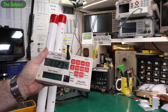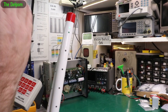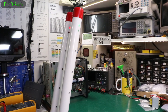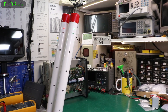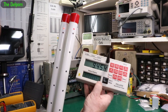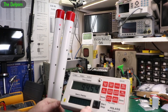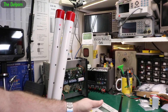It looks like it had just forgotten its programming. Going back into the RF testing — the first one is coming up as F like before. Now the other one is showing zero, and it's beeping but showing zero. Is it overdriving the input? That's also showing E. Maybe F isn't the highest value — maybe zero is the highest value because it goes over scale. So it's potentially a firmware bug: if the signal is too strong, it shows zero instead of F. There's a learning experience.